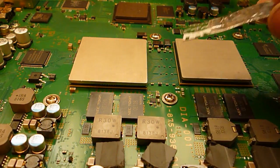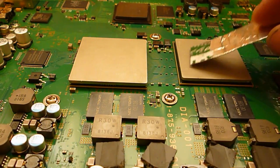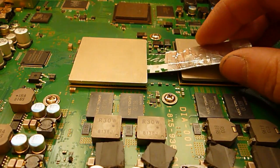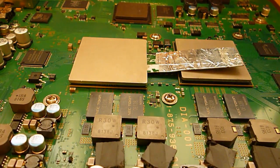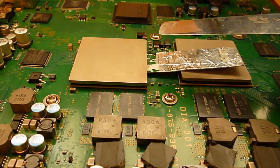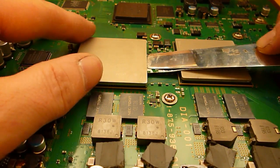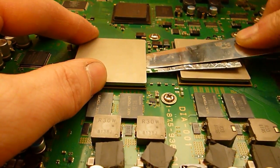Basically, went from this side here where the CPU is, because there's components around these other parts and you'll damage them. If you just put a wee bit of card in there, make sure it's good and thick but still thin enough to get this in, because you don't want to damage the chip when you're doing this. Just put some in carefully.